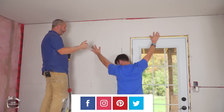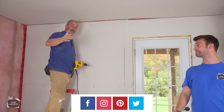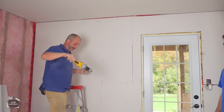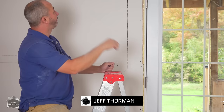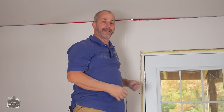Before you let go, make sure you get a screw near the top — otherwise if somebody opens the door, the air pressure change will pull the drywall right off the wall. I learned that one the hard way. If you're watching this and wondering how he's going to fill all those gaps — this is not a problem if you have the right tools, equipment, and know-how, and that information is going to be in the next video. Click the link here to find out what we did. Don't forget to subscribe to the channel and give us a thumbs up if this helped you at all.